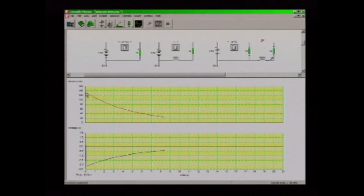So the current that was initially flowing through the inductor is decaying away exponentially. So now our new circuit is like this. And it's in fact the inductor that's driving this current through this circuit. It's driving a voltage that is pushing a current through these two resistors. And the reason why it's doing that is because there was a current initially, and the inductor resists a change in the current. So if at all possible, the current will keep flowing, and it will flow through these resistors, but as the energy that was stored in the inductor is dissipated, the current and the voltage will both approach zero exponentially. In this circuit, I can close the switch, open the switch, close the switch, open the switch, and nothing dramatic happens.